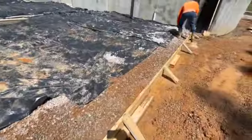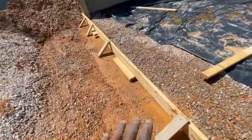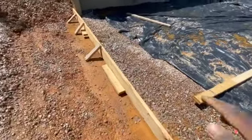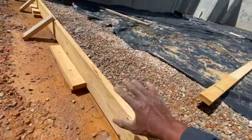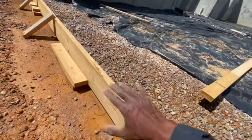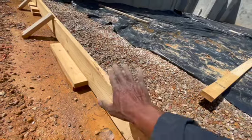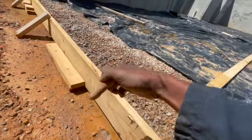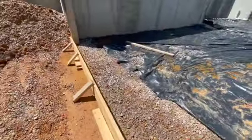There's another reason — when you actually get the door in, for the garage doors it's a little different. We got to make sure that we slope the concrete right here in the area where the garage is, slope it so that water won't try to go back up into the garage. We're going to slope it downward, tilt it down a little bit. That's why it's important to know where those openings are for the garage.